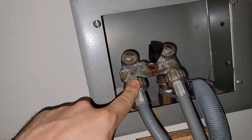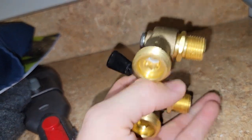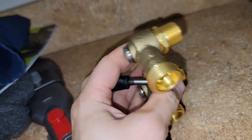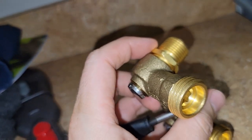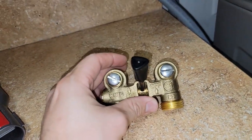Basically it involves draining the water, and you got to remove these two screws and you can thread these off, or you can just screw the new one on. Depending on how those look, I may end up reusing them and just changing the washer or the gasket, or replacing these things with a wrench. It's a little tight under here — you need a big screwdriver to get these things off. So we'll see if we can get it done.